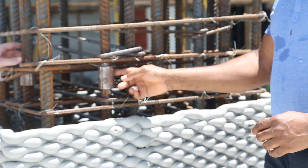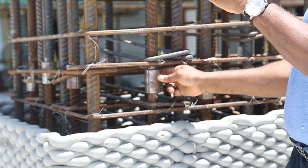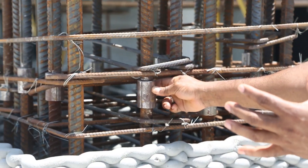The first part — you can see the design we have used here — is a special design with stronger shear strength in order to withstand the workload going on top of the building. The second part is the rebar, which in conventional building is the same in 3D printing: we use rebar. An important component I wanted to show here is this joint system.